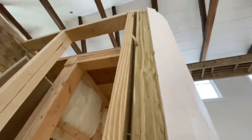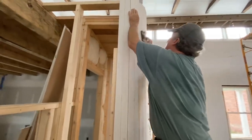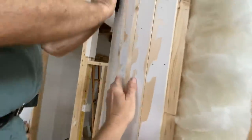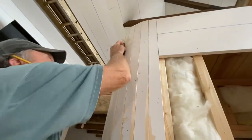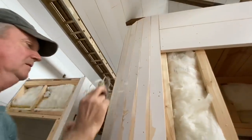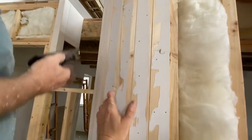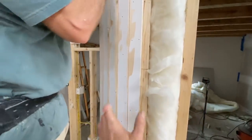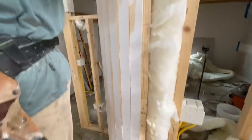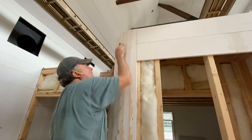You can see what we've got going on — tons of glue, all pieces installed. The edges were not perfectly flush and had a little bit of a catch between each board that I didn't like. To fix it, we're simply taking off the corners with a hand plane. This thing is going to fall somewhere between round and faceted. I really like the faceted look because people are going to be touching this, so we're just scraping down the high points until we get a little smoothness.